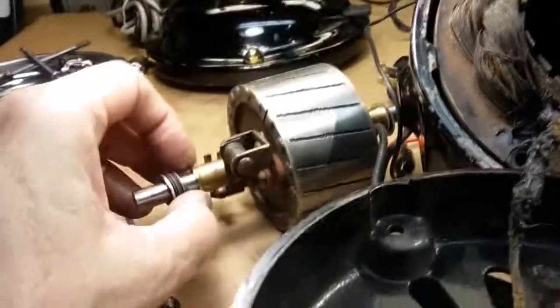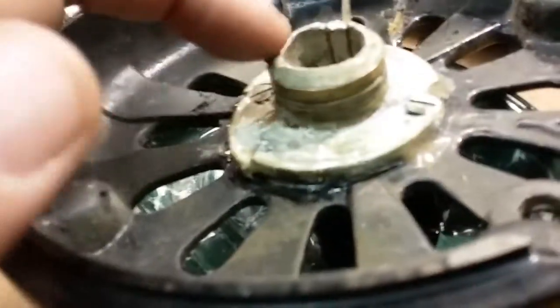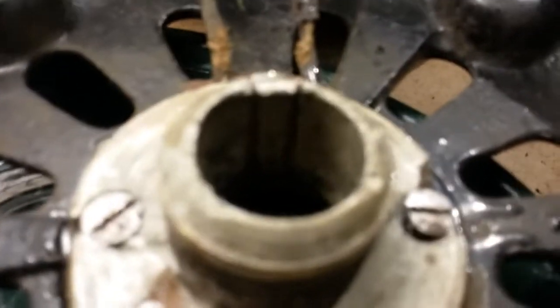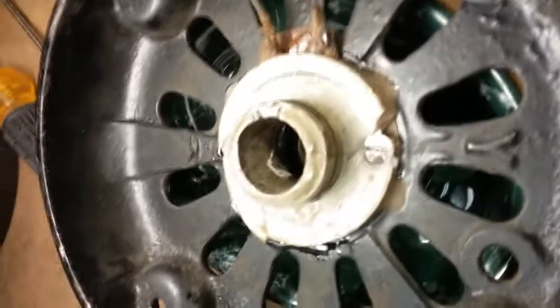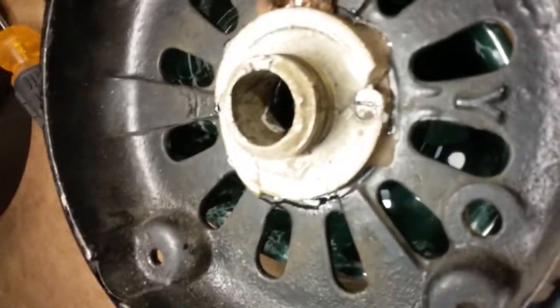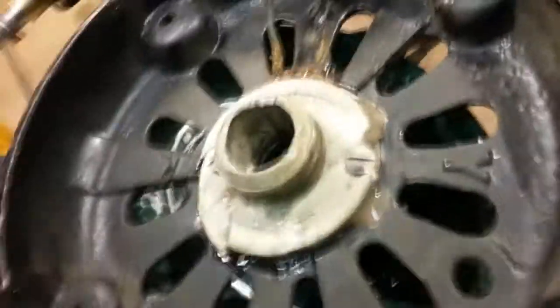I mean, I know that this is worn down, but this is the culprit, and this is in bad shape. This is totally deteriorating. And inside too, you see cracks in there, surface cracks in there. They're not cracked through, but that's stress from heat and things. And you see on this side, let me shine it down in that wall. See, there's deformities. You know, it's probably made in a, well, oh, it's definitely cracked through there. That's not good. I didn't even see that. You see where it's broken right through? There's no way that this is going to last for any major length of time. It's going to need another one of these contact plates designed.